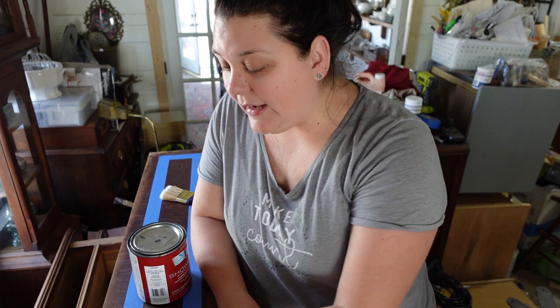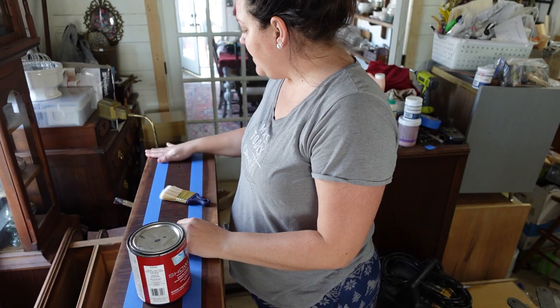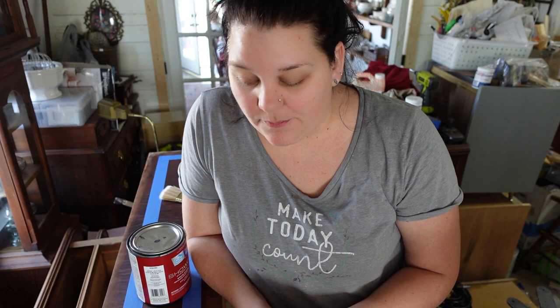That being said, okay. So I'm working on this drawer here and I have taped it off. My plan is to just tape it off and paint, and I'm not going to worry about the veneer problems on the edges because I tried filling them in with Bondo, but the veneer is so thin that when I sanded it down, it just dissipated. So what probably should have happened was I should have just ripped all of the veneer off of this piece. But then at the same time, much of it would have been destroyed doing that. So I'm doing what I can with what I've got.